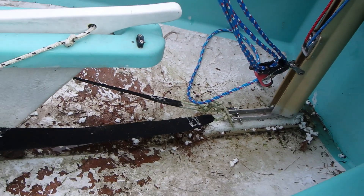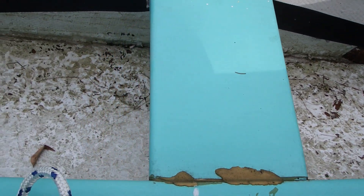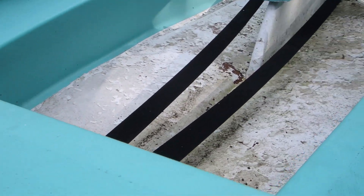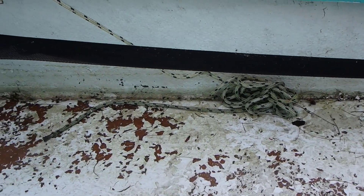The mast step is in good shape. Interestingly, there's no bow tank plug. The floor, beyond being dirty — all this speckly, flaky stuff is white paint. Someone painted the floor of the cockpit and it's all flaking off. Power washing will probably strip that off. The question is whether we put gel coat on top, because the gel coat has worn off over time. It's just flaking white paint with gel coat — or base resin coat — showing through underneath.